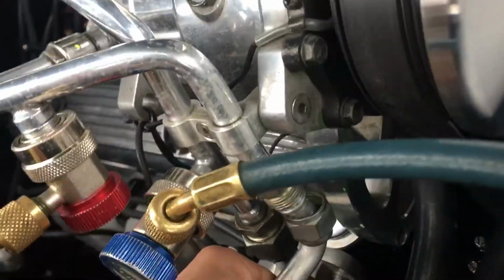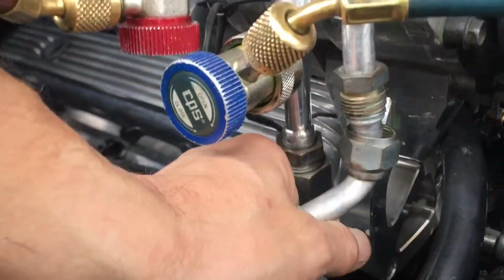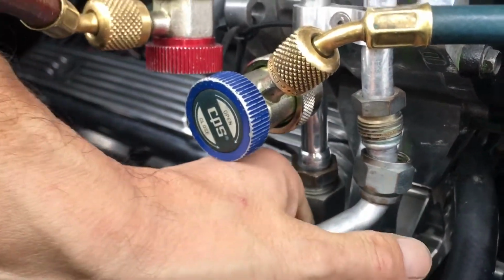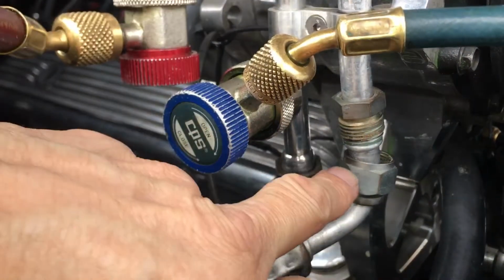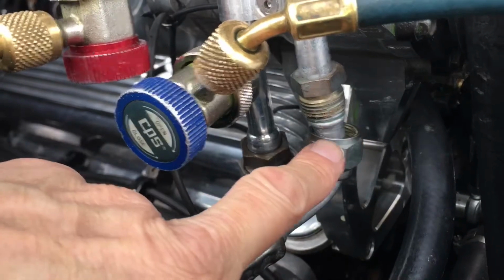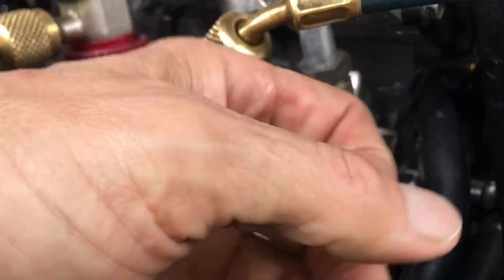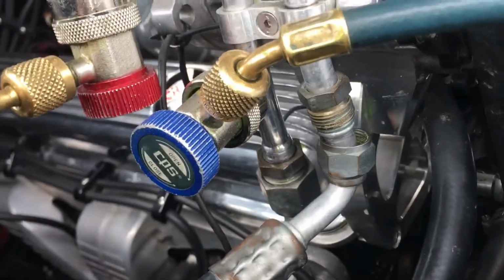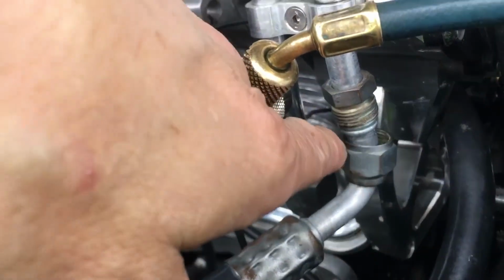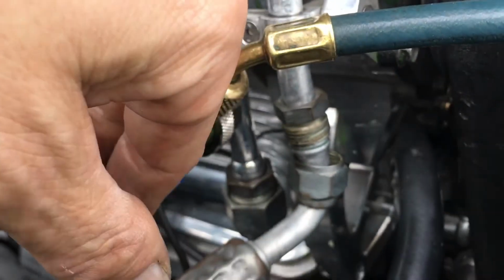You want to make sure and look all the way around that you do not pinch your O-ring. You're in level. You do not use the nuts by grabbing the first thread, and if you can't get this nice and square and flat and straight, you do not use the nuts to pull it in and straighten it out and force it. This is how you over tighten. This is how you pinch O-rings. This is how you gall the metal and you do damage on the back of the metal.